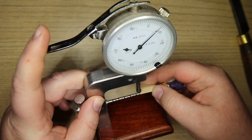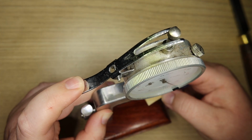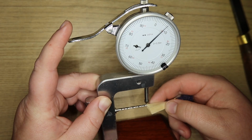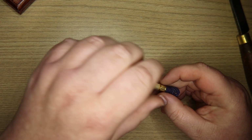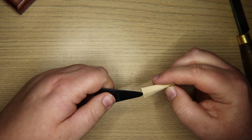Okay, I'm right around 7/1000 of an inch, and the second one is maybe closer to 8, but I'm not too worried about it because I can always come back in and take that down. I'd rather leave it a little heavier and then come back later and clean that up.